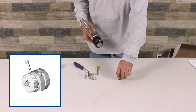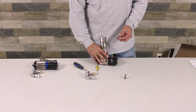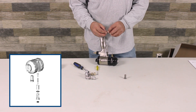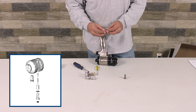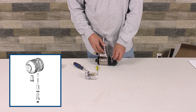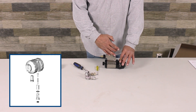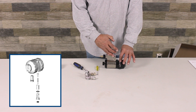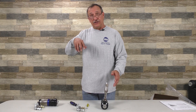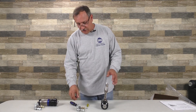Once you get that done, you're going to put your screen check valves in. Make sure these screens are clean with no obstructions — just clean it off and push them in. At that time, do not put air to this. If you put air to this and pull the trigger, these are going to pop out. Usually people wait until they get out to the job and plug it into the air, already hooked to the gun block.